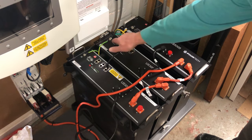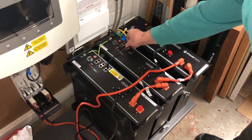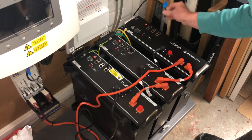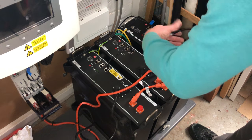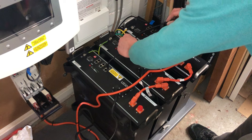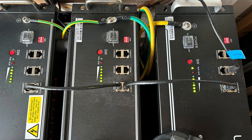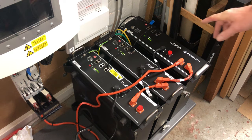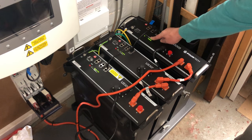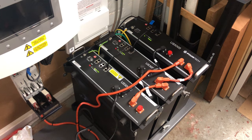I'll switch them all on. I only need to press the SW switch on the master battery, and I also need to move the CAN cable across. I also need to fit the link port cable — from upper to lower, so port zero to one. Now we can see the batteries have powered up. This new one is slightly lower charge as you'd expect, just come out of the box. The two original batteries are fully charged; this one is showing about four out of six LEDs. We're going to leave that now for about half an hour.